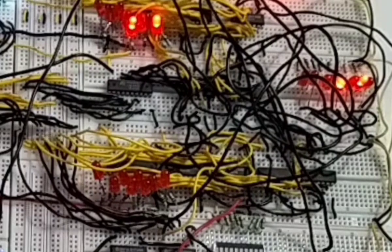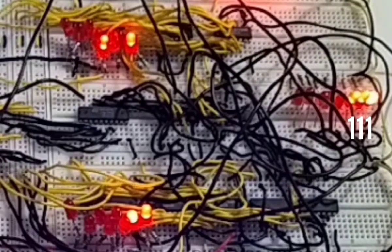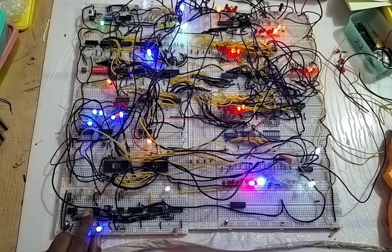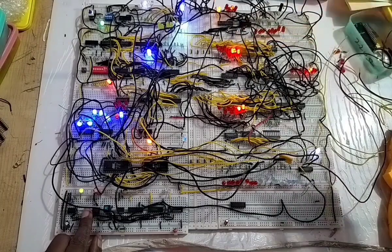You can see the 3 which will come into the B register. You see the result is 7 right now. This is the 7 and I want that 7 into the output register. The sum goes into the A register — sum out comes into the A register — you can see 7 there.